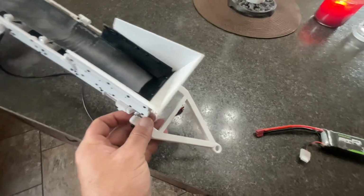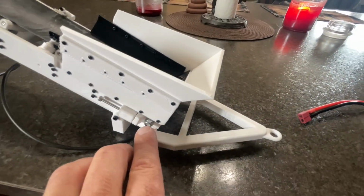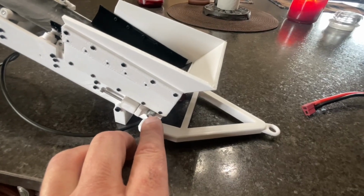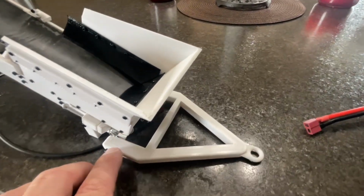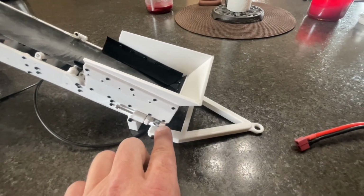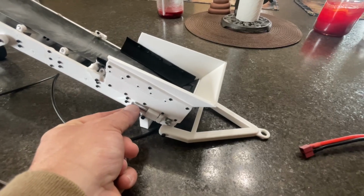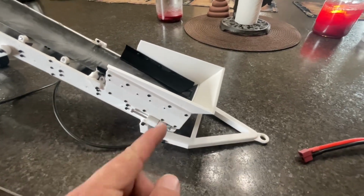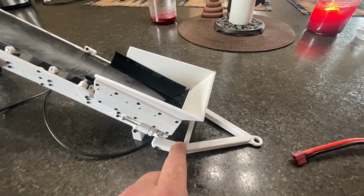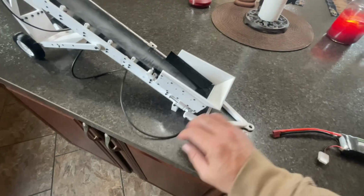And what I ended up doing, I changed everything, changed the rollers. What I ended up doing was actually tightening these down a lot more than I thought I had to, and it actually straightened everything out. So now with just even a quarter turn, you can adjust it going in and out. And on this conveyor belt, I actually added a spiral roller on it. So it's kind of cool